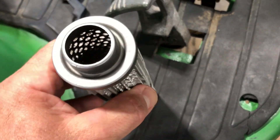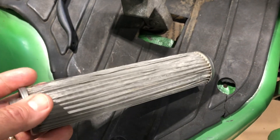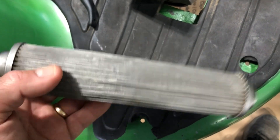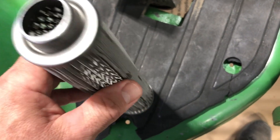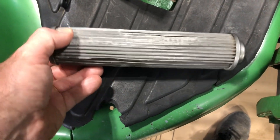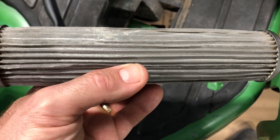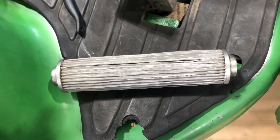The real issue causing slow hydraulics is when the fluid starts to go bad. When I say go bad, it either has water in it that's been there a long time, and it'll turn milky — white-looking versus clear. When that happens, it's a sign you have water or some contamination in your hydraulic fluid. That fluid becomes too thick, can't get through the screen, and it plugs that screen up. The screen becomes basically a wall — fluid can't get through, causing slow hydraulics and other issues.